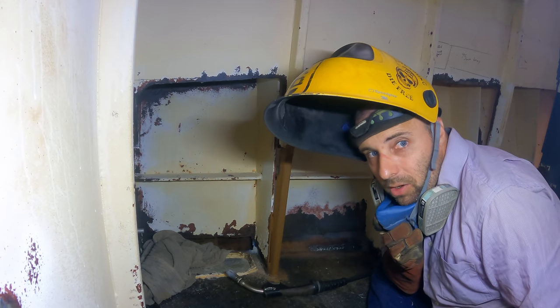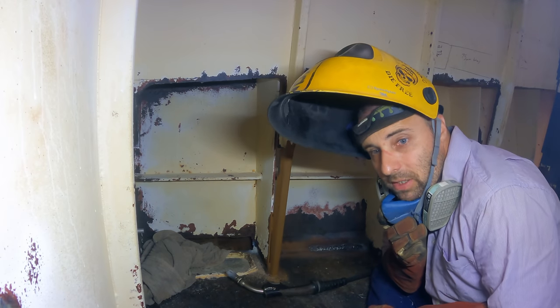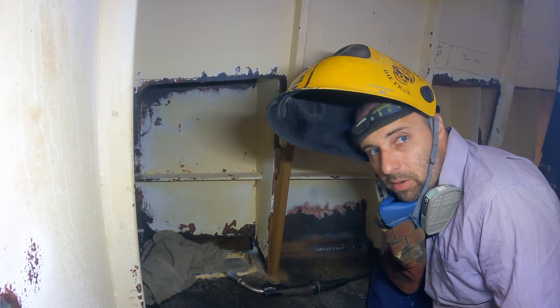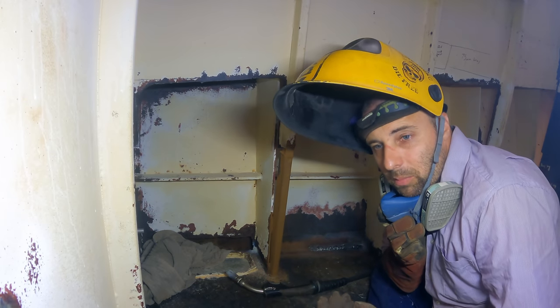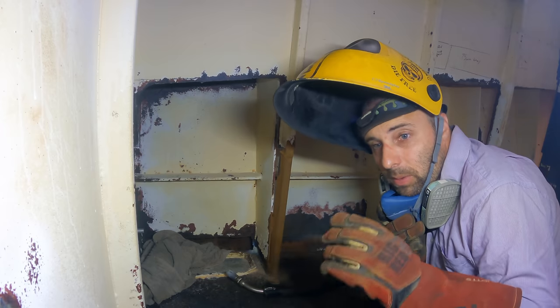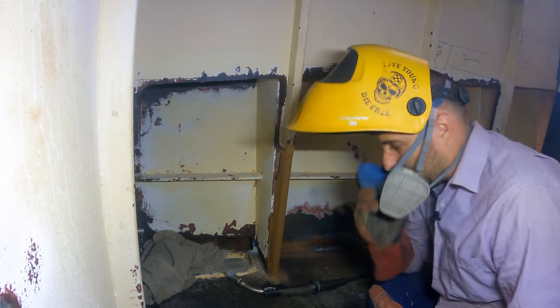It doesn't matter how long it takes to do pad welding because it's infinitely faster than replacing the panel. And if you blow through it, it's not a big deal, you just need to fill it back up with metal. Remember, you're basically melting liquid metal and you're liquefying the metal around it, so it becomes as permanent a bond as what the original panel used to be.